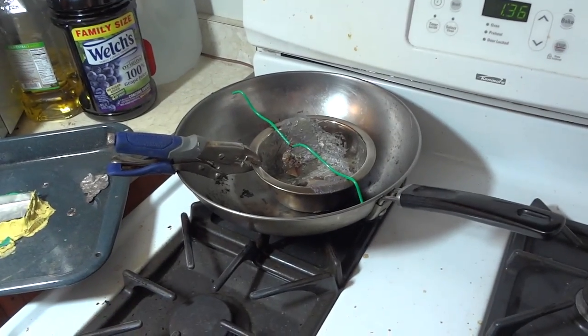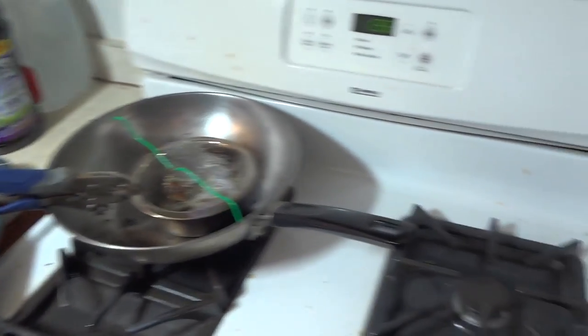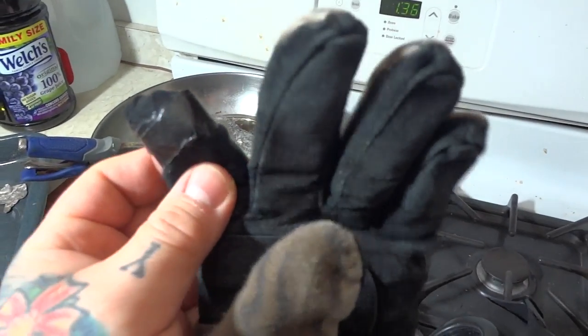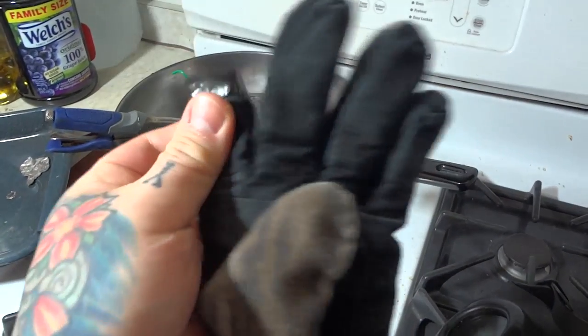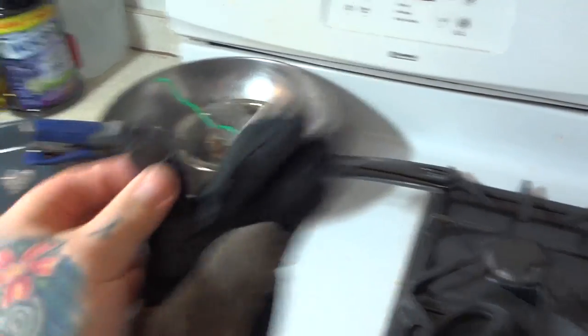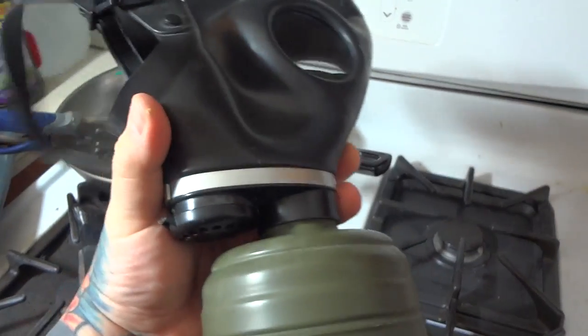You have to use absolutely 100% pure bismuth if you plan on doing this indoors. I turn on the fan. I wear a pair of gloves — you can see they've got duct tape on the index finger because I burned a hole in it. I also use a gas mask while I'm actually melting my bismuth over top of the stove.